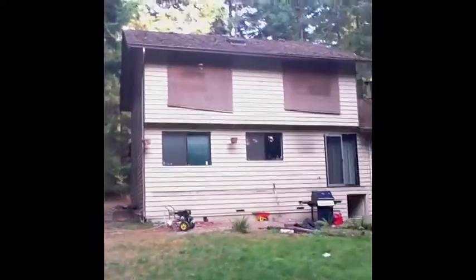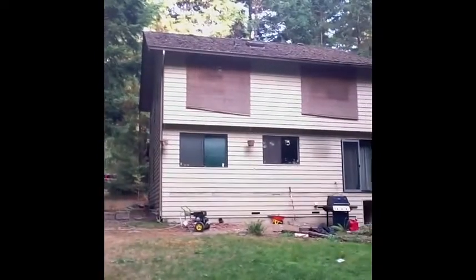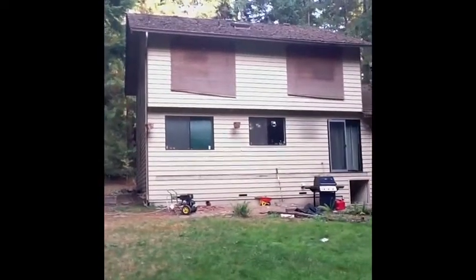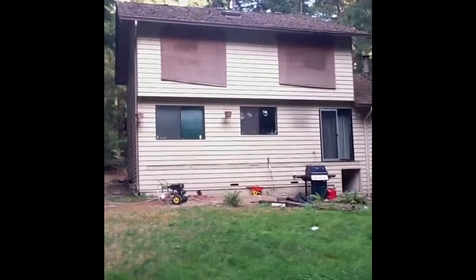I'm in the backyard now. I'm going to go back a little bit so we can get a view of what the house looks like. As you can see, there is one skylight up there. If you notice, up past the skylight on the upper section, there are three box vents. We're going to remove those vents and install a ridge vent system.